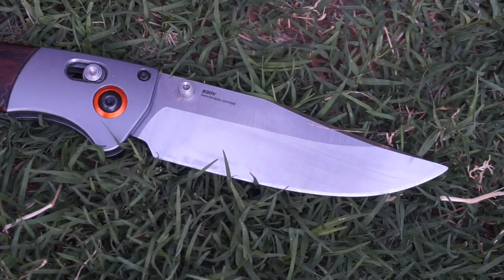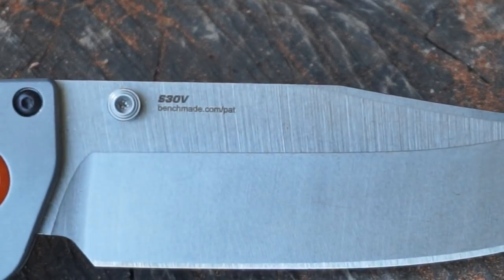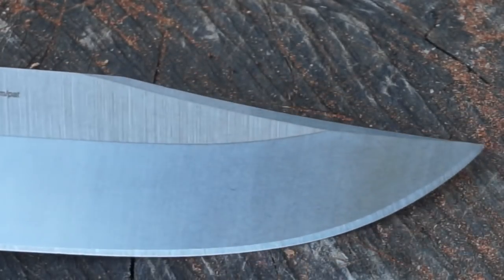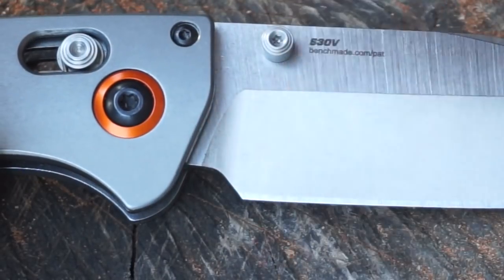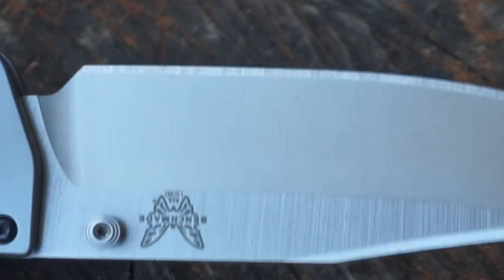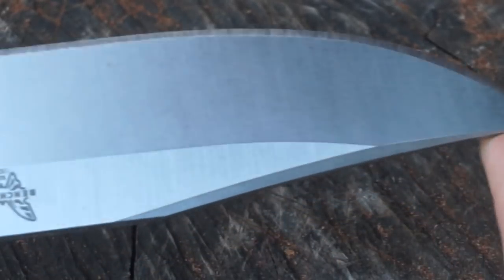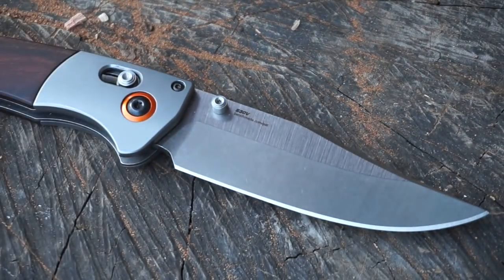The blade is made of S30V. It's got a saber grind — that means it's flat to about a third of the way down, and then it has another flat area going off at a different angle, and then you've got the cutting bevel, which is like the bottom couple of millimetres. This blade is a really good performer for the intent behind it. It's a clip point, which means it has that sudden drop-off, and it has a swedge too, meaning the steel where it drops off has been ground inwards as well. That's all for making it more of a pokey, slicey type knife. Hunting knives have quite often been clip points — your basic Case knives, your Barlow knives, very often clip points. Drop points are also quite synonymous with hunting, but the Buck 110 Folding Hunter is a clip point knife. So this one's going for the same aesthetic.